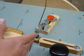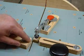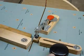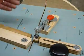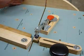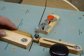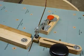So for ease of operation, I simply omitted that. When I made my first cut, it basically made almost like a zero clearance cut on the fence, which helps with chip out. You'll also notice when I bring my sled back and unclamp a piece and push the other piece up, the saw is still running — but I bring it back far enough, and this piece here, which is essentially the bridge, also acts as a safety. Even though I don't get my hands anywhere near it, if for some reason I happen to slip, I've got a little bit of safety there. It does double duty, and your hands will thank you.